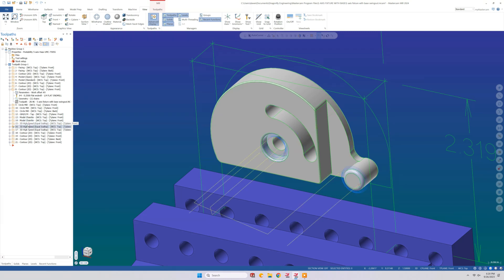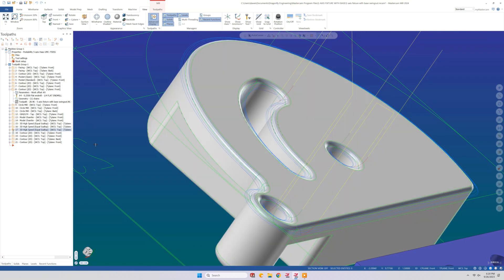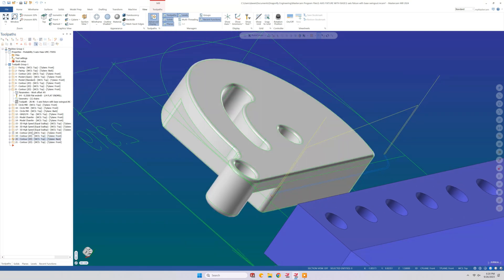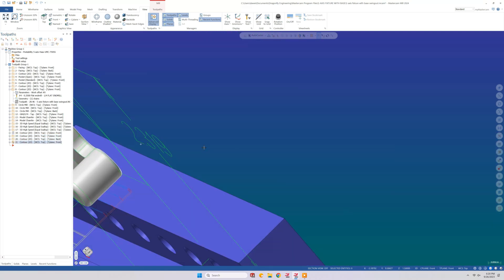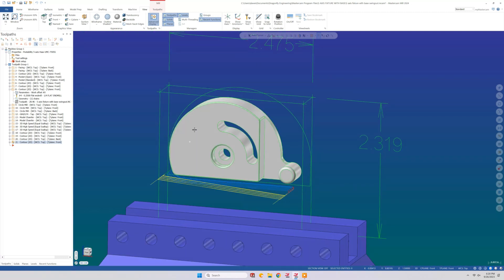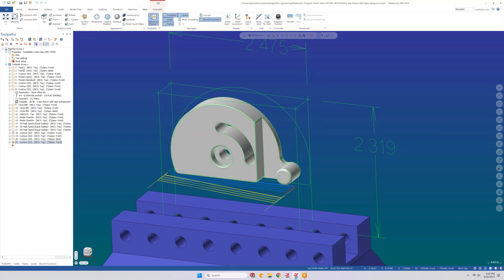Then there are some finishing operations using a ball end mill, which goes around and cuts a radius on the sides of the profiles — I think it's a one millimeter radius. At the bottom, we clean up the bottom surface and then cut the part off using a quarter inch end mill, basically just slicing off little bits until the whole part is hanging on by a sliver. And that's all the tool paths.